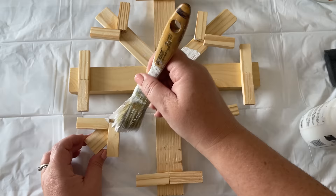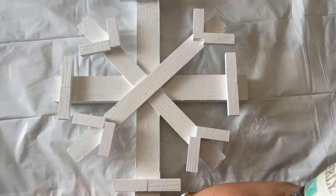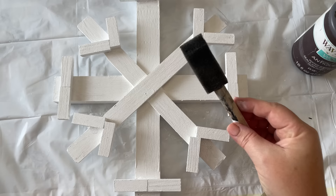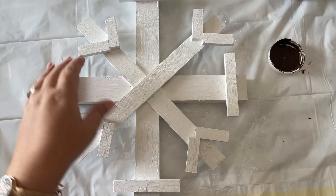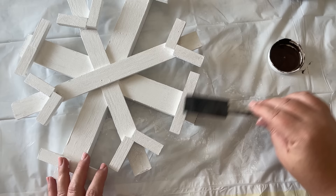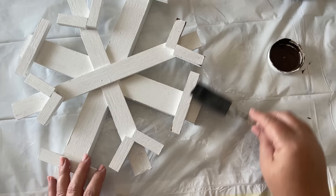Let your wood glue dry at least overnight before painting with white chalk paint. Then we're going to do what my sister and I used to call 'dirtying up.' When we would paint a piece of furniture white, we wanted to primitive and distress the edges, and we'd call it dirtying it up. Take any brown paint — in this case I'm using the Waverly Antique Wax — with a foam brush, and with a very tiny bit of that brown wax on your brush, dab it onto the edges and corners of your project. There's no right or wrong to this process, but if you get brown paint where you don't want it, just cover it back up with some white paint.